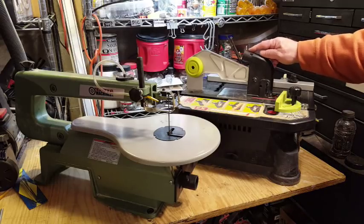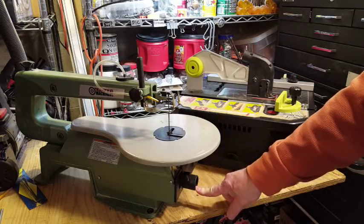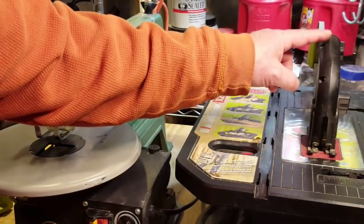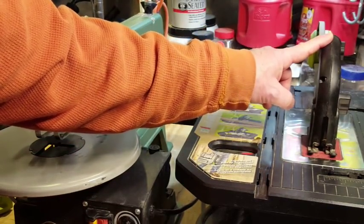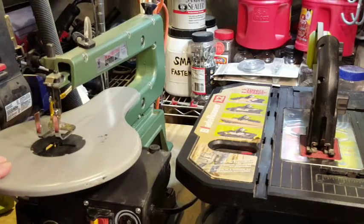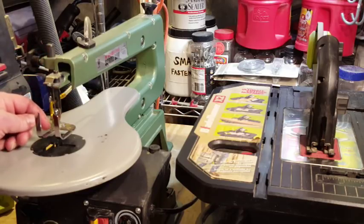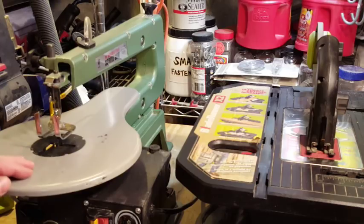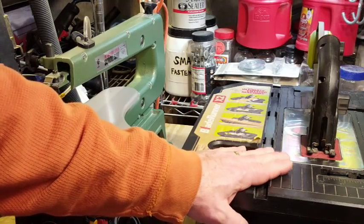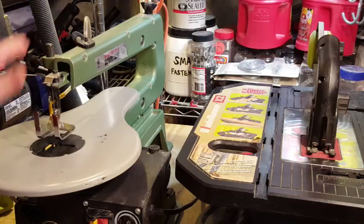The Blade Runner has the ability to connect a dust collection or vacuum cleaner hose, and the scroll saw also allows you to connect a dust collection or vacuum cleaner hose. However, the Blade Runner relies exclusively on that separate vacuum source to draw away dust from the cut. The scroll saw uses a bellows mechanism built right into the saw to produce little puffs of air that blow sawdust away from the cut. So the Blade Runner uses vacuum via an external source, while the scroll saw uses positive pressure from an internal bellows.